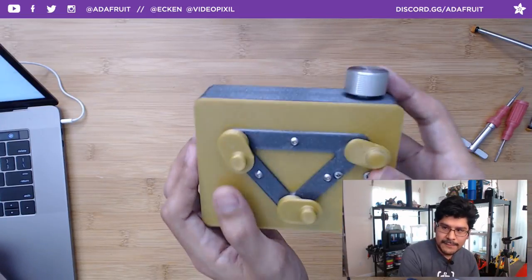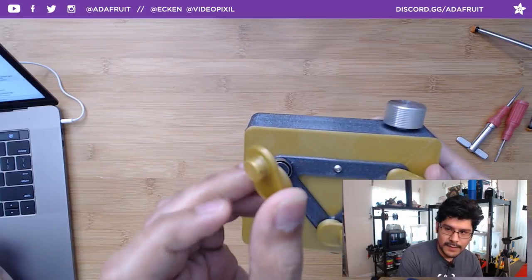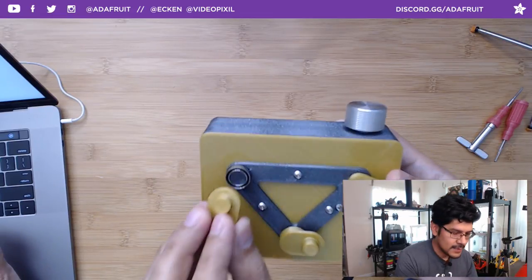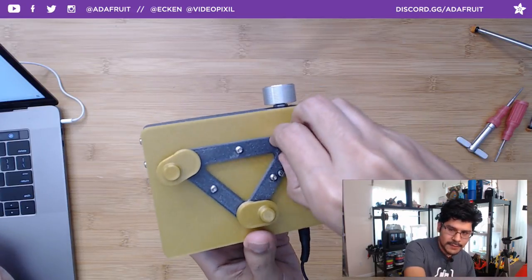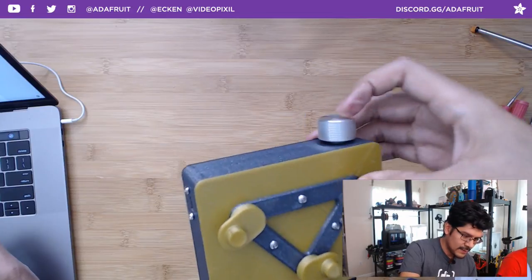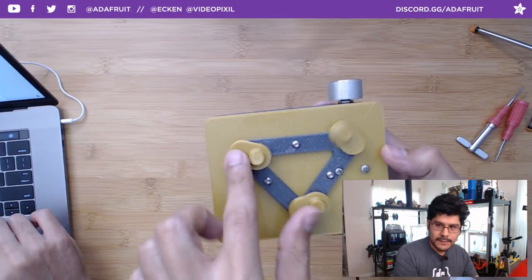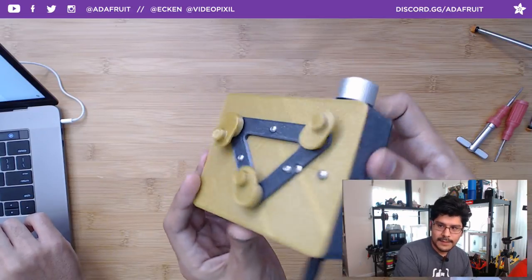And then this is the platform that houses the pivot points. You have these little pieces here that allow the ball bearing to fit on this end and on the bottom end. And then this bracket here keeps those elevated and separated. The shaft of the motor is actually right there, and this gets plugged in like that so that when you turn it on, this rotates, and when you have the platform on top, it'll just go with this, because these are like the slaves and these are the masters, and they're just going along with it. So that's how that works out.